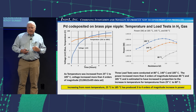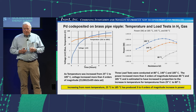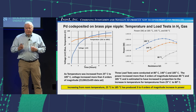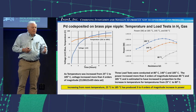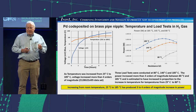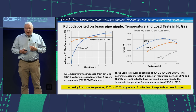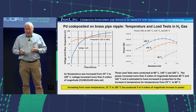Another thing is temperature. The orange line shows increase from room temperature, about 25 degrees, up to 185 degrees C. The blue line is the open circuit voltage, which went up almost five orders of magnitude, starting at about 0.01 millivolts up to over 500 millivolts. We did three load tests — at 80°C, at 145°C, and at the maximum temperature of 185°C. We believe temperature can increase power by three to four orders of magnitude.